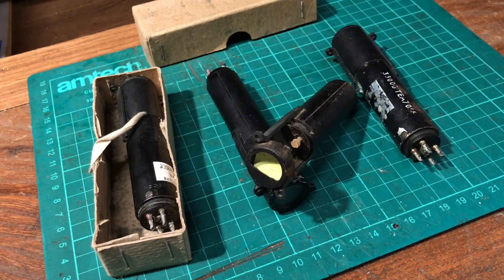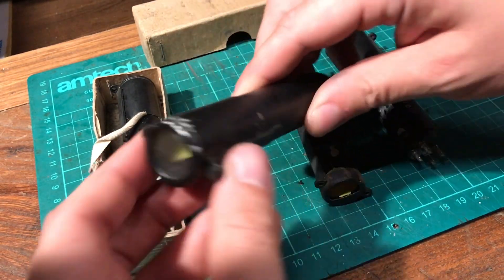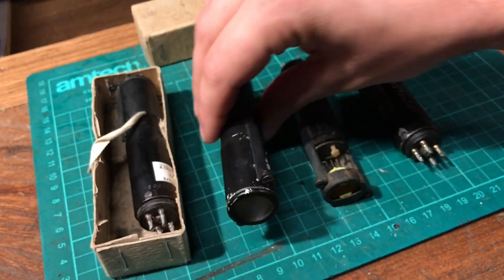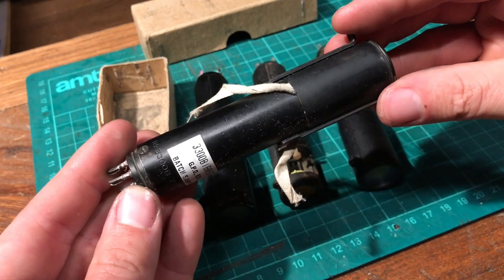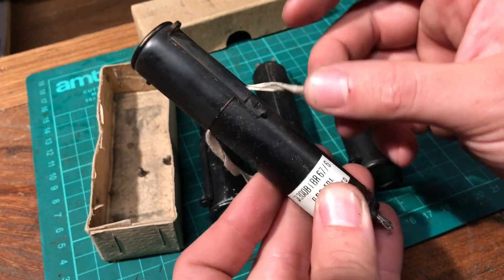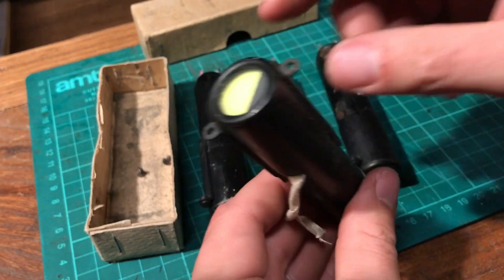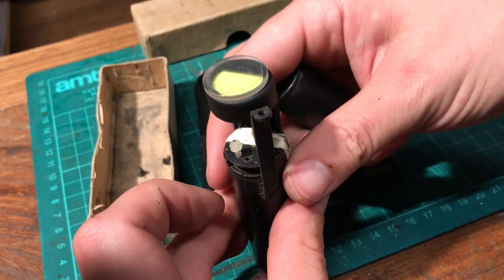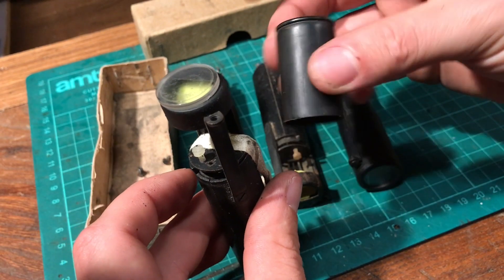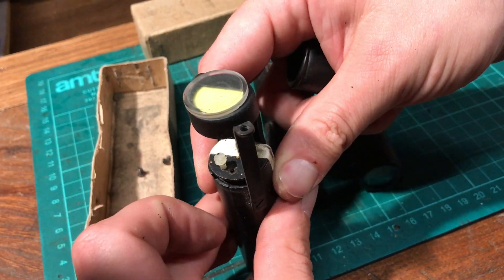Let's give it a go - let's try and get some of these working, shall we? The good thing with electromechanical stuff is normally it's pretty simple, that's why it's quite reliable, so there's probably not too much wrong with these. This one is pretty much as close as you're going to get to a new old stock one. It's even got this little bit of fabric that stops the flap rattling around. If I open it up here, this little bit of fabric is held down by the outer cover and that stops the armature moving up and down.